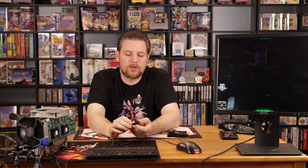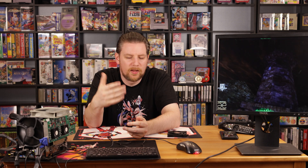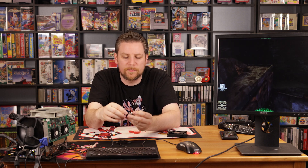After doing all that research on PWM fan controllers, I realized I could do something a lot more professional: give these fans proper 12 volts and use the PWM signal to control the fan speed rather than just reducing the voltage. I can also make the board configurable so at any point I can go and change the fan speed — fine-tuned control at any time rather than just switching a voltage. So I came up with this design.